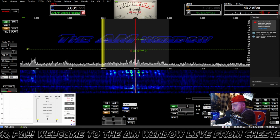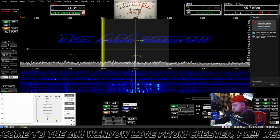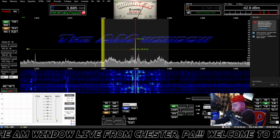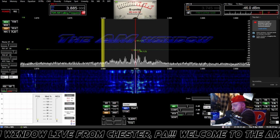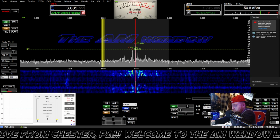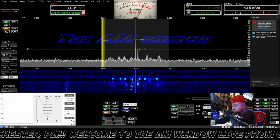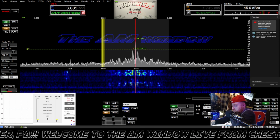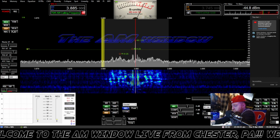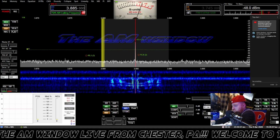So that's the story. What kind of antenna are you running? I'm running a mystery antenna. It's up about 40 feet, fed with 300 ohm twin lead, tuned to 14.175. I put a choke at the base of the antenna and feed it with LMR 400 equivalent, about 76 feet of that. I'm not running a tuner there, Bill. I can load right into this antenna. It's only 99 feet across the top. I can do 20, 40, 80 and 12 meters with it. Not a problem.